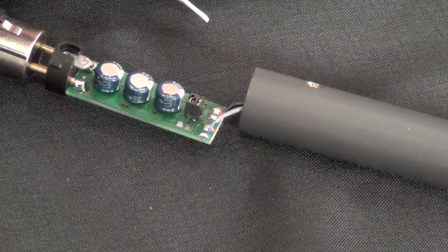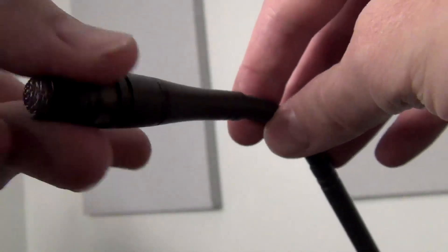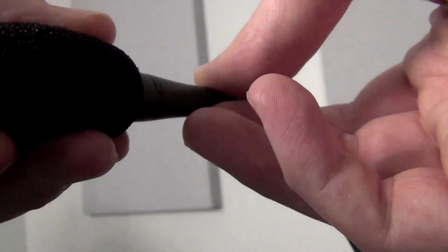Installing any of the five compatible CK microphone capsules to the GN gooseneck module is easy. Hold the gooseneck with two fingers behind the base, and gently seat the capsule in by twisting the gold-plated thread into the base until it stops. Once secure, slip on the additional windscreen.